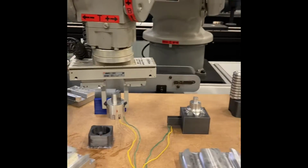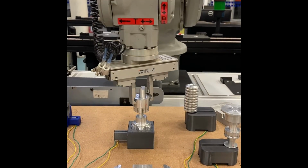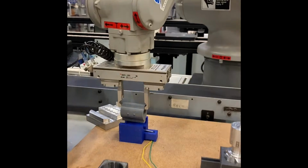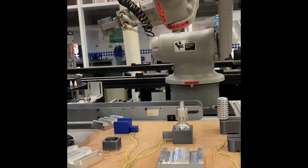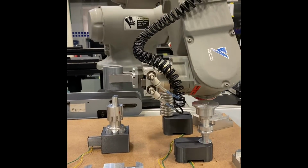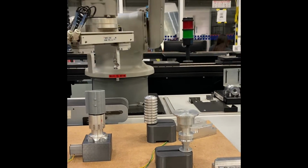Once each of the parts is located properly in its base, the robot starts the assembly process. The first piece, which is already located in the assembly station, doesn't need to be moved. From there, the 4 remaining parts are located one over the other, ensuring all of them are positioned and oriented correctly. That is why all the project was performed using Poka-yoke techniques.